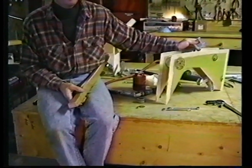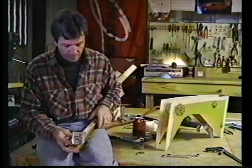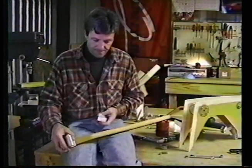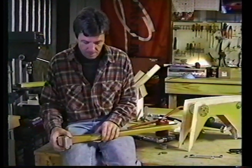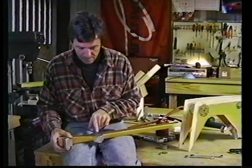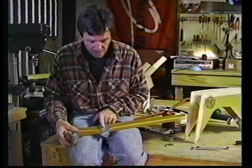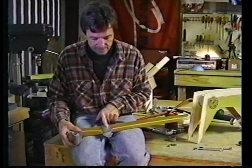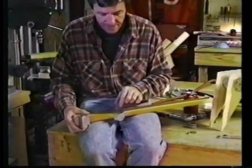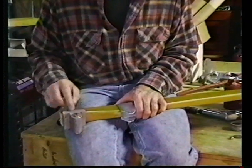This is what is preparatory to actually installing the NG30 in the aircraft. We'll get this done first. Once this hardens, we'll remove it and then make sure that the NG3 and 4 are mounted in place. Center to center, 6.71 inches, same as the Long-EZ. These are the Mark four Cozy brackets, giving much combined thickness here, a much greater wall bearing on the 5/16 inch bolt that goes through here. And we'll be back to you once we start to bond this in place.